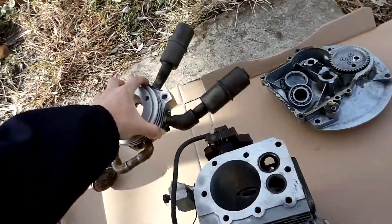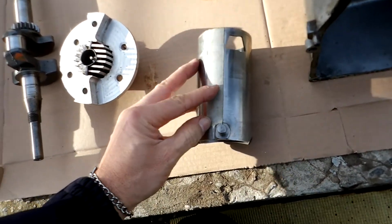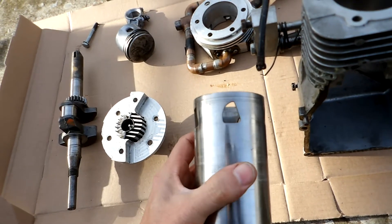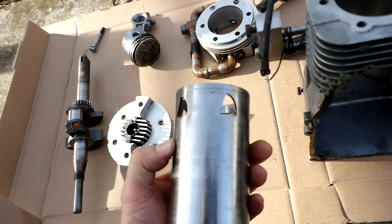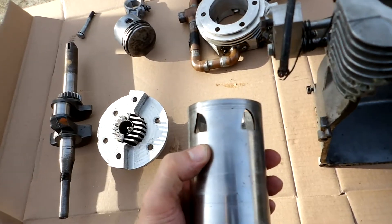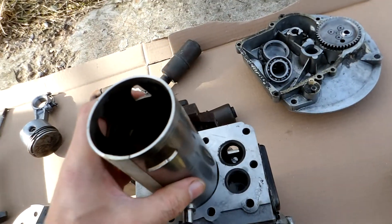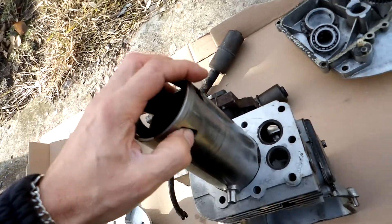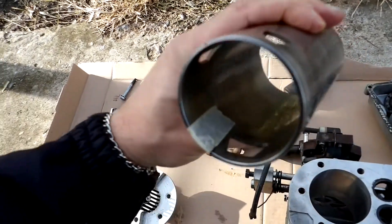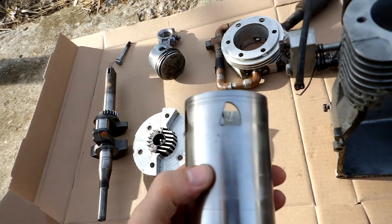Here's the sleeve — I've got a piece of masking tape stuck to it as a reference line from the center of the sleeve drive pin. There's your compound port, so you get an exhaust and intake out of that. This one is an exhaust port, and these two over here which are identical are intake ports — so the oddball has to be exhaust. The sleeve drive goes downward, so this port is exhaust, this port is exhaust, and then intake and intake at the bottom. So there are four ports in the sleeve, plus the compound port that does both intake and exhaust.